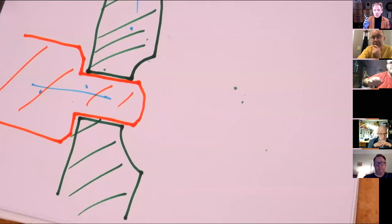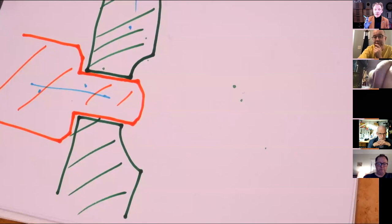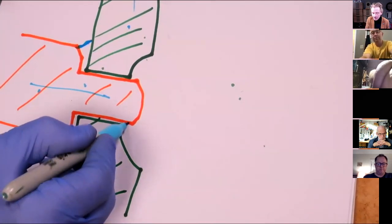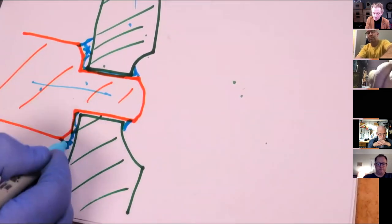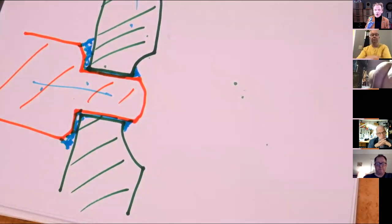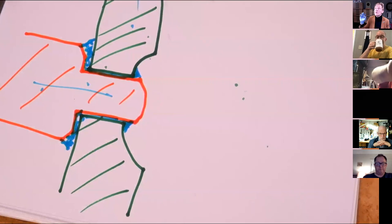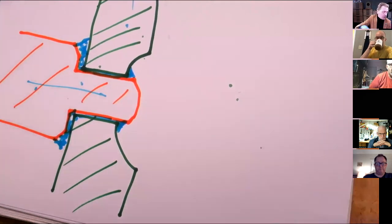Okay, the reason we use brass and steel together is because in relative terms, brass and steel have got a low coefficient of friction, but they still need added lubrication. So that's the oiling part. And when we oil a bearing like this, I'll draw a little meniscus here, we get oil in between here, like this, like that, and there's a little meniscus around there. And unlike a car engine, there's no labyrinth seal, there's no neoprene seals. It's just open to the air. So this oil gets contaminated and it spreads and it goes thick and it turns acid.